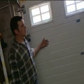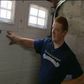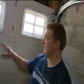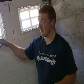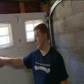Now, what are you looking at? I know putting a big steel door on a garage, I mean, at the end of the day, it's a big steel door, and with the price of energy shooting up, which is a constant consideration now, is a big steel door not going to let out a huge amount of heat or let in a huge amount of cold? In fact, it does the opposite, because even though the door is constructed of galvanized steel with a polyester coat, it's actually a sandwich construction. So you have steel, polyurethane insulation, and another layer of steel inside. It's completely sealed all the way around on the exterior, and there's a bulb seal across the bottom. The glazed ones then come with double glazing. It keeps in the heat as well. They're completely airtight, and there's a thermal break in between all the sections and a seal between all the sections.